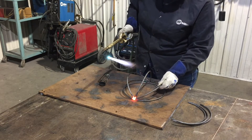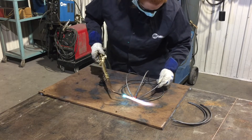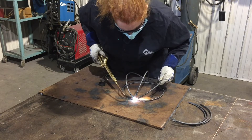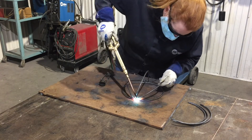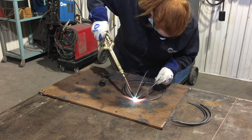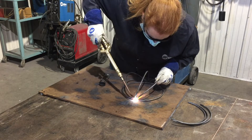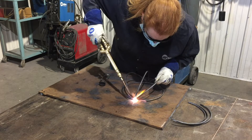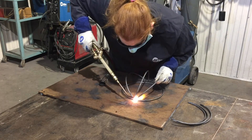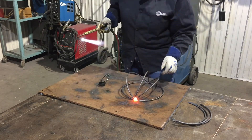I'm not putting any filler rod in yet. I'm just tacking each of the ends, so I line this one up where I want it and keep that heat in the piece I have already put together. I am being a little careful not to hit my previous tacks, and then I just heat up this new rod introduced into the system until it is liquid enough to have a little drip that falls into the heat of the existing pieces. There it goes — you saw the sparks and it's held in place.